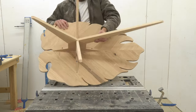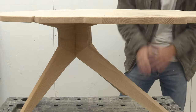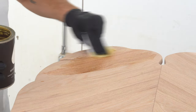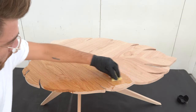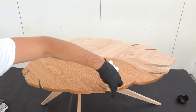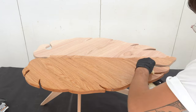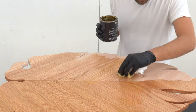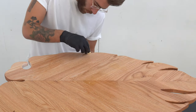At this point in the project, I was getting hype. Ta-da! Now we're going to apply finish and we are done. I put on two coats of Maker Brand Simple Finish, which is a basic oil finish with wax included. This gives a little bit of a top coat protection and really enhances the grain. For this project, Danish oil, polyurethane, or wipe-on poly would also be a great solution. Applying finish to a table really is one of my favorite steps because you finally get to see all of that sanding work come to fruition.